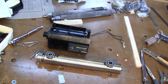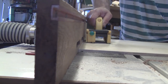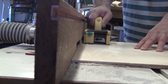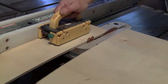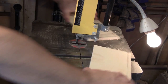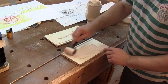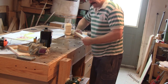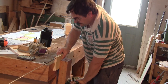But my motor is different from the one Matthias used, so I must make a different type of support for it. I start by making a quarter inch wide groove on a quarter inch thick plywood and rough cut it to size. I cut it in half and glue both pieces together. This will be the pivot base of my motor. I just have to make sure both pieces are well aligned so a quarter inch stainless steel rod fits inside both grooves, and I leave this to dry.